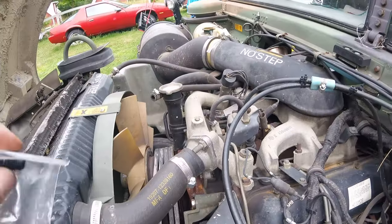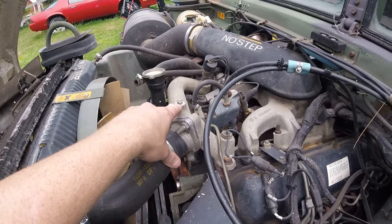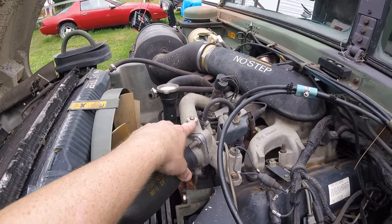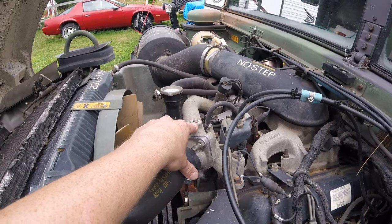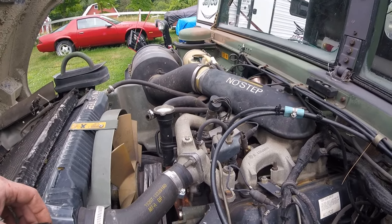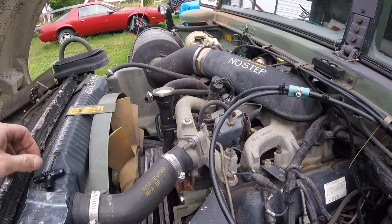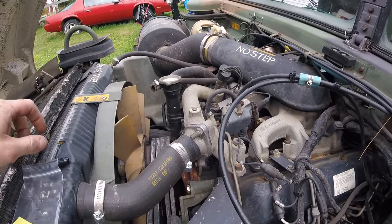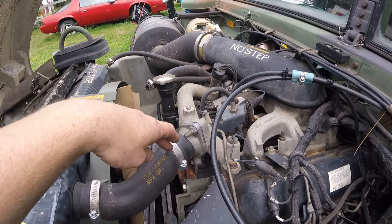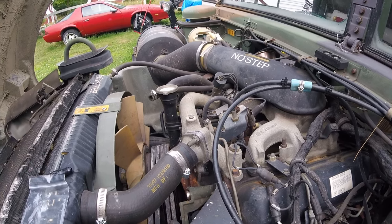Got the old fitting off. A top tip: metal has a memory, so when you're trying to get something off that's been on there a while, don't just try to loosen it right away. Always try to give it a snug first — that's the last direction it was turned. Tighten it just a little until it budges, then back it off. Especially important for hollow fittings which have a high probability of cracking. Now installing the T-fitting with thread tape — make sure the overlap of the tape ends in the opposite direction you're tightening, otherwise the tape will bind and you won't get as good a seal.